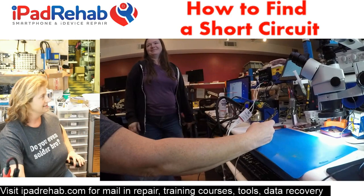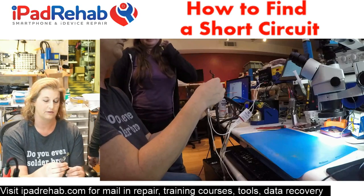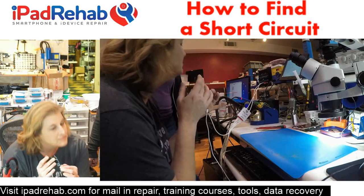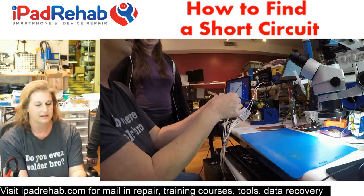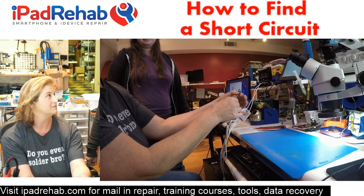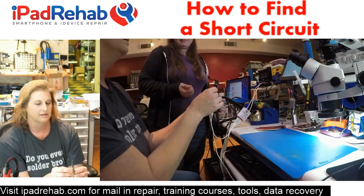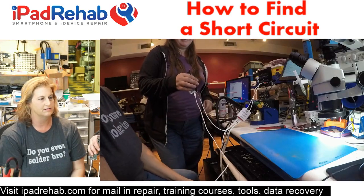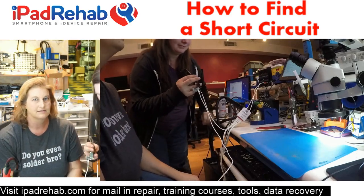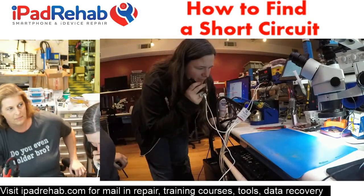All right, ready? Here comes a good sport, Christy. Sharon has identified, she's done the hard part for you. She knows that there is something getting hot around here. So your job is to see if you can figure out whether it's the PMIC, audio IC, or Wi-Fi. That sometimes gets short. See if you can start with it here. Those are getting hot. Not instantly. No, they don't get hot enough. So get prepared, and then we'll hit go and see if we can find what tiny spot gets hot first. Ready? Okay. Go.